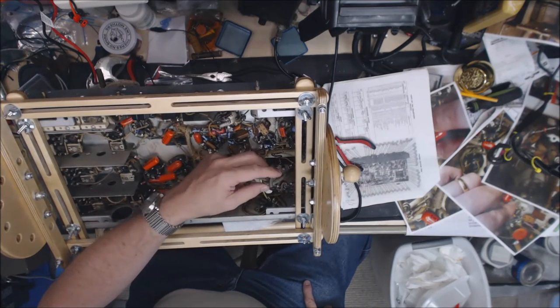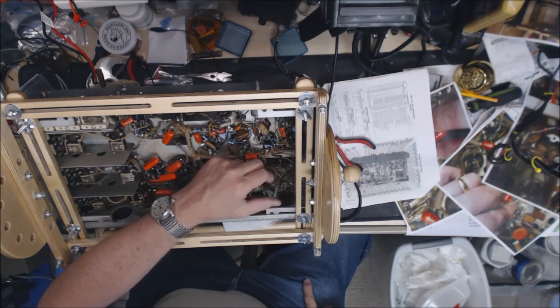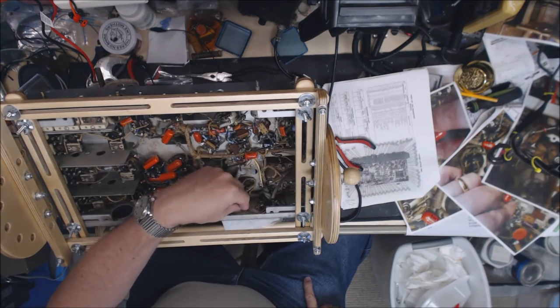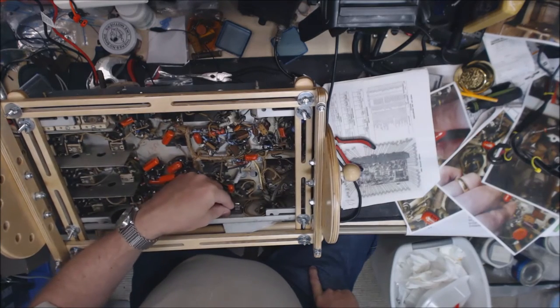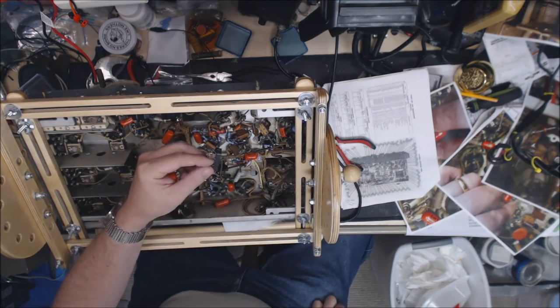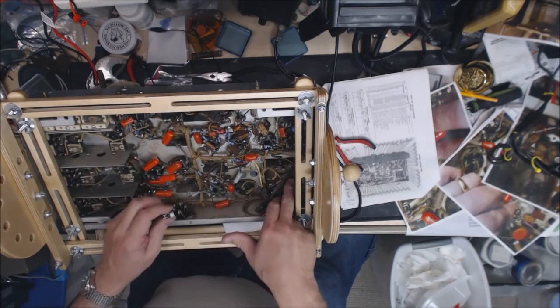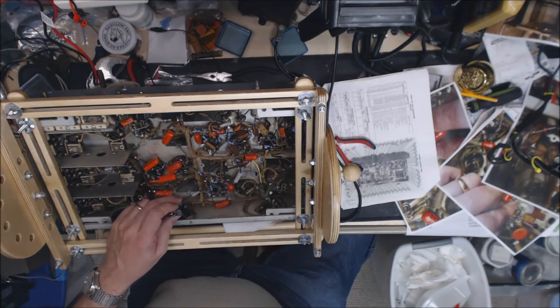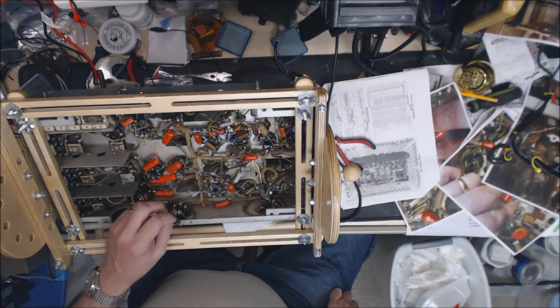Like I said a little bit ago, I left the cord hooked up. I'll replace that with a three-wire cord and go ahead and ground it. Glue a fuse block probably right about in here, to provide an extra level of protection. So I'm going to shut the camera off, do my little bit of research on this, and then I'll come back and we'll replace that cap and get the rest of the wiring done, and move on from there.